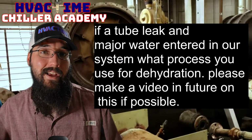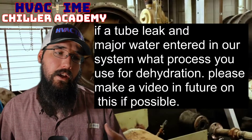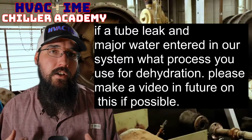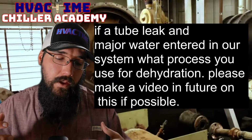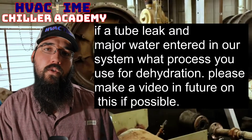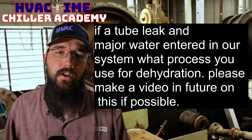Whereas with the state it's at, everything probably needs to be serviced and cleaned, but you may not have to have the motor rewound. Some of your bearings may not be in that bad of condition. Doesn't mean you can't replace them, but you're not risking the impeller making any touchdowns anywhere it's not supposed to, and tearing the impeller up. Those are the consequences of, oh, let's just see what happens, right? And now your $100,000 overhaul turns into a $150,000-$200,000 overhaul, if it's even worth overhauling, depending on how severe it is. So just things to consider.